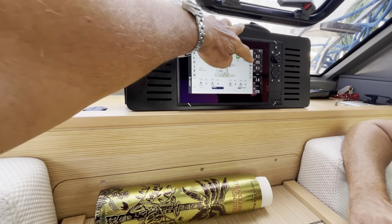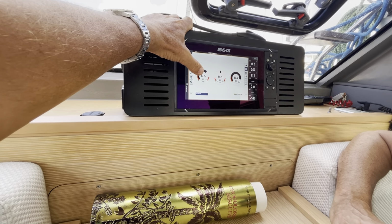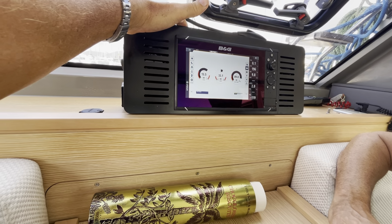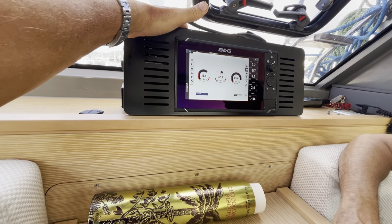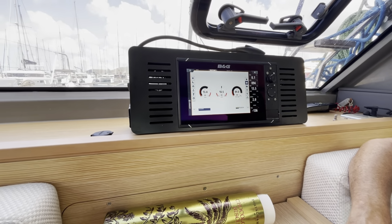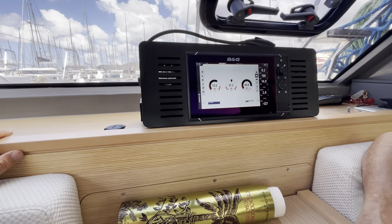Okay. So then your battery state. You can see it's 9:30 in the morning, it's 13.5 volts, 89%. So basically the fridge ran during the night. Okay, loading 33 amps already at 10 a.m. I'm very impressed with how efficient those panels are. The panels are great. The two things to bear in mind are in January, the sun's at a different angle, and you get less power. Yes. And when the rainy season starts. Yes, of course.